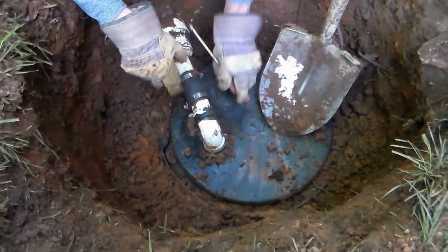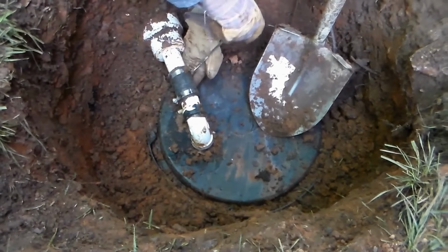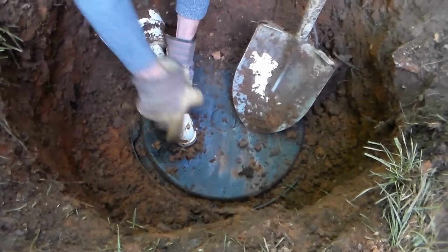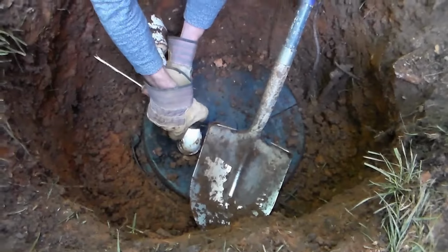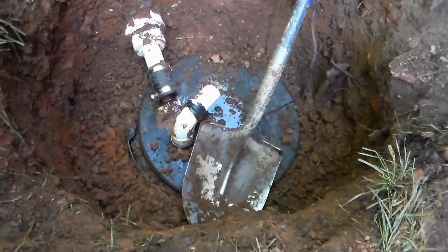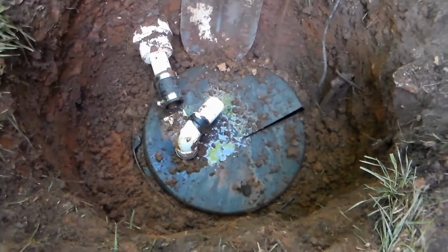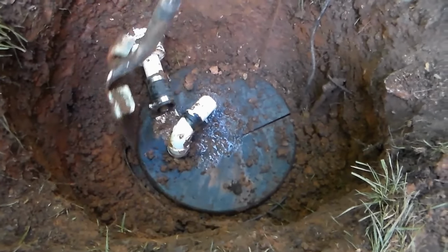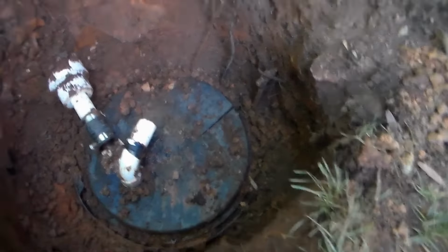Right now we're taking apart the no hub so that we can pull that pipe apart, and we should be able to pull that lid right off of there. You can leave that side on. Yep, good. He's pulled it apart, and now we should be able to lift that pump up. This is a real tight install. There it comes. It's coming right up. Just get one side of it and pry it up, Paul, where you got it already up. Yep, just try to pull that whole string up out of there.